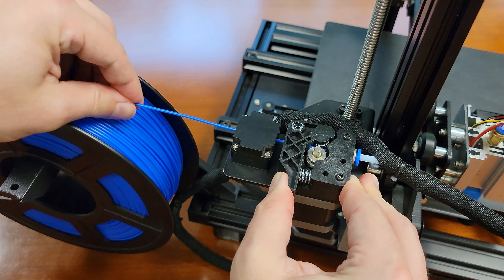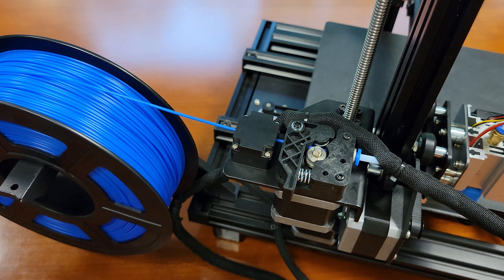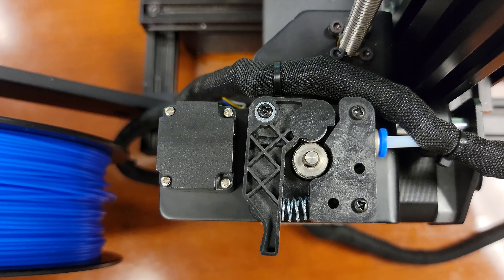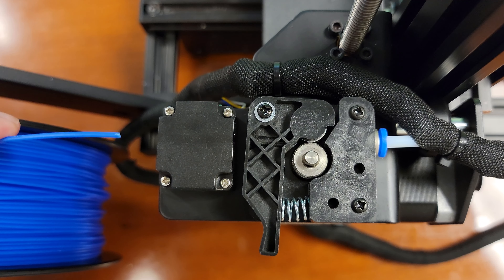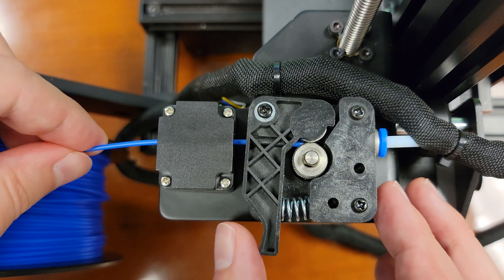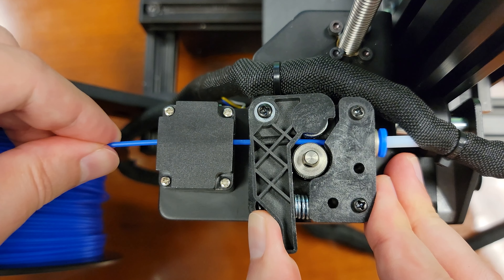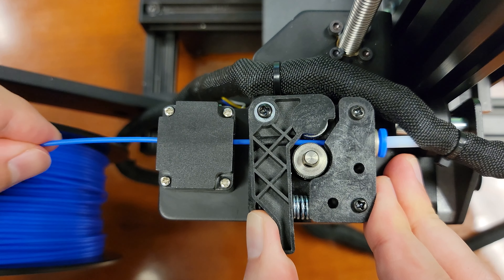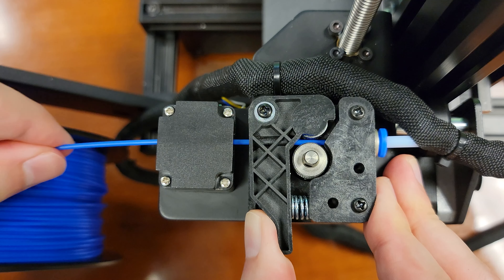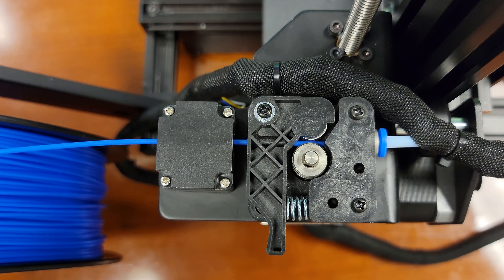Partially compress the release lever as you feed through the filament. Don't try to completely squeeze the lever because it will push the tip of the filament away from the next opening. Now comes the interesting part — you have to feed the filament through the tube that leads down to the nozzle. You just have to feel your way as you feed the filament until it hits the end. There's a small bump at the end that tells you you're at the nozzle, and you won't be able to push any more filament through. I'm not sure how I feel about this setup. I do like that the feed motor is directly aligned with the filament spool and the tube makes sure the filament doesn't scrub against other components, but swapping out filaments will be more tricky than the V2 since you can't see how much filament is in the tube. I'll have to investigate the best ways to get that done.